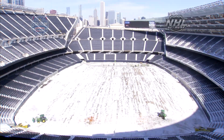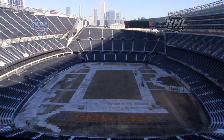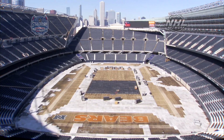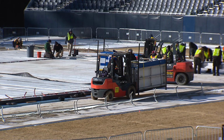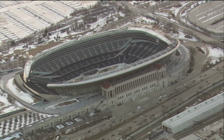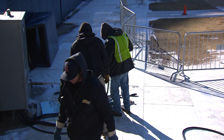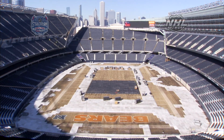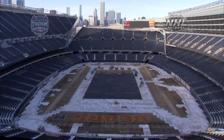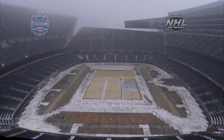A normal setup time will probably be 3 to 4 days from the time that we start to the time that we are spraying water to start our first layer of ice. But what happens is we build a deck. Doesn't matter what stadium we go into now, whether it's a baseball stadium or a football stadium, we build a level deck as close to the ground level as we possibly can. On top of that deck, which is a staging, we put 3/4 inch plywood on that and screw that onto the staging to make everything as rigid as we possibly can.